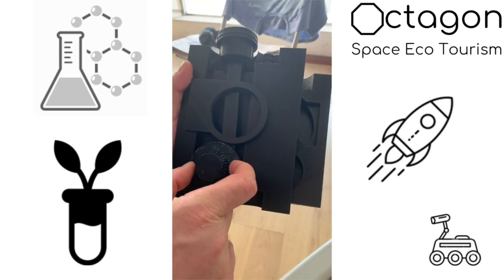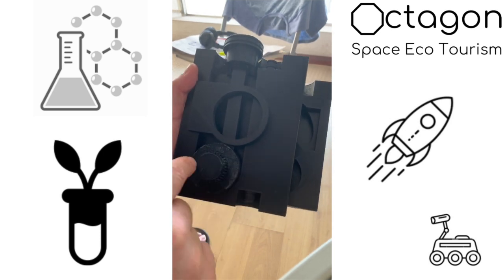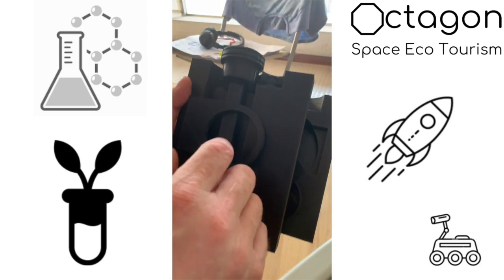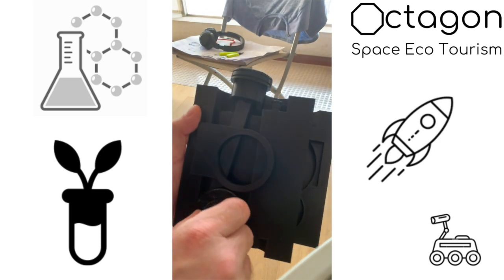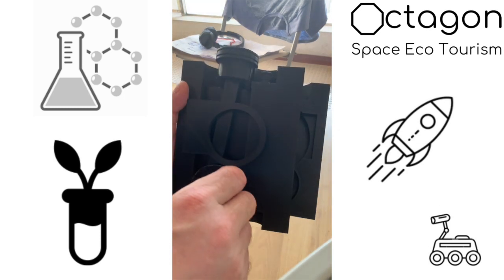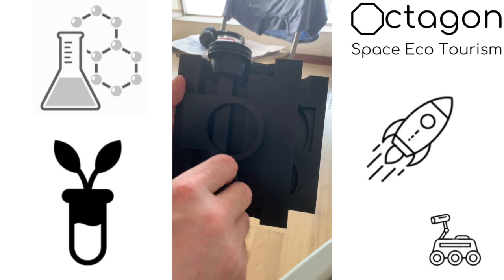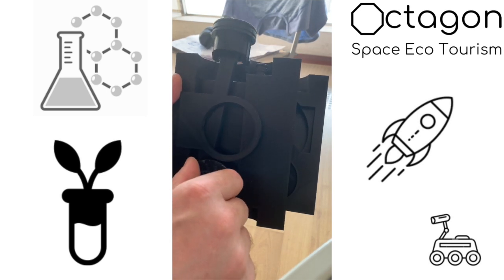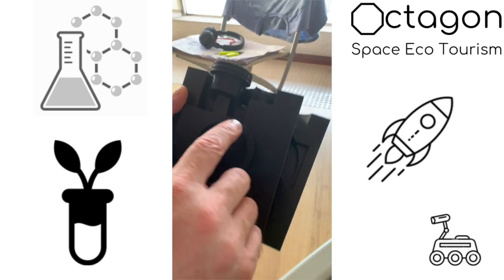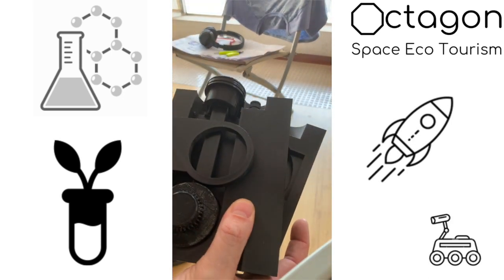And I believe the stroke, if I look at the center of this on this side, the distance over here, I do believe that it's 3 centimeters or 30 millimeters, and that turns into the displacement of 30 millimeters up top. In general, what I use when I'm trying to create a seal is 12 millimeters. So if we use that as a reference in terms of how high this goes up before it starts to come down again, we're getting more or less 3 times that distance, I think anyways. But again, looking at the CAD files will reveal all. We can see that we've got a couple of slots for the piston rings. I printed these up a while ago.